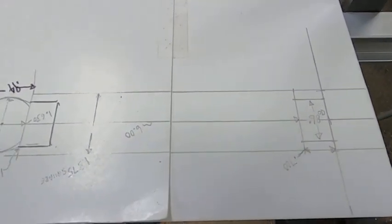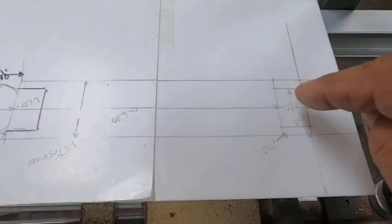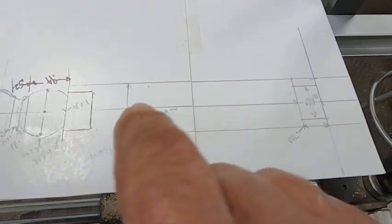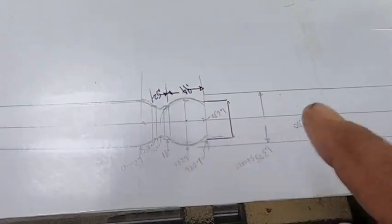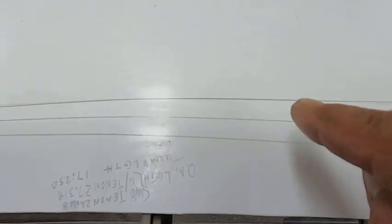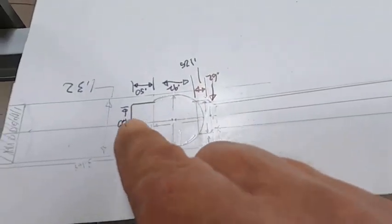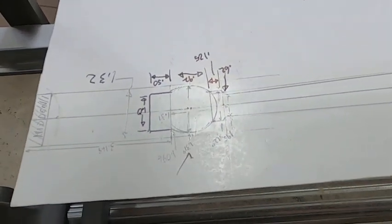It's the only way I can figure out to get it in. So there'll be the tenon, which will be a piece of dowel. There'll be the bottom square of the baluster, which will also have a mortise in this end, which I'll drill, so that the tenon on the turned spindle fits into a socket or a mortise on each end, okay?